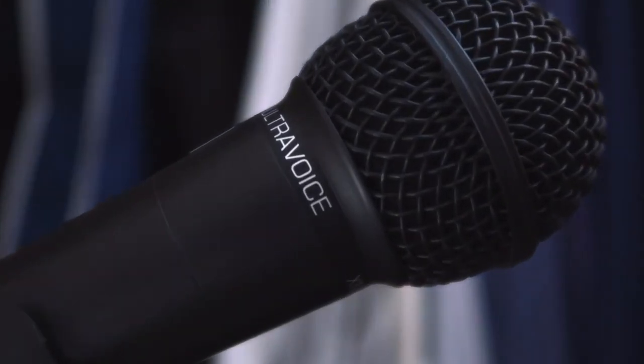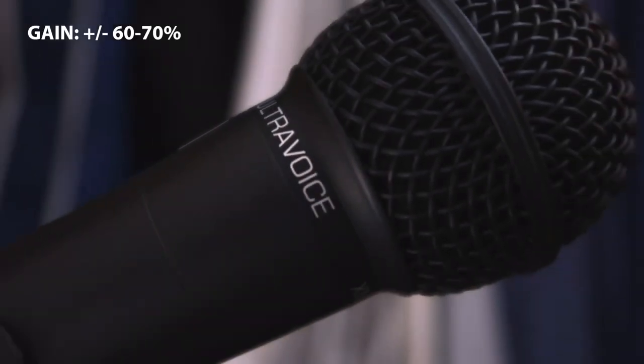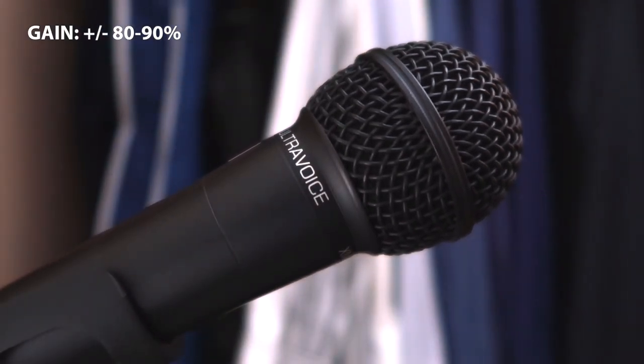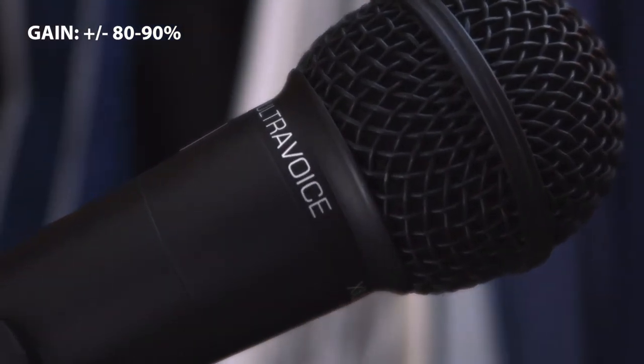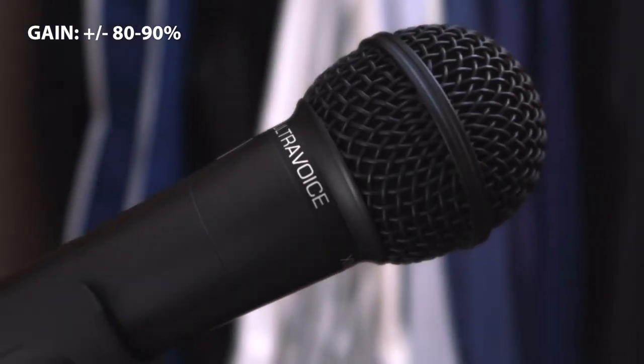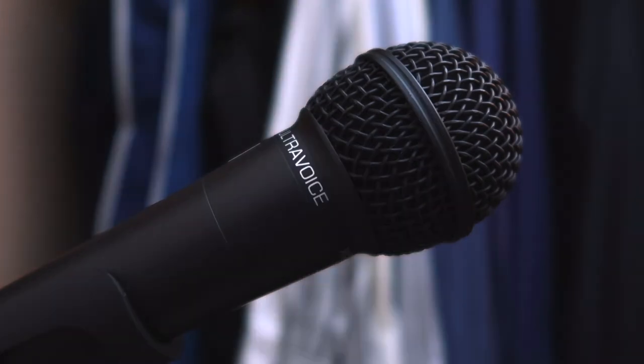So I'm cranking up the volume of this microphone. I now hear a bit of volume coming back and I'm still cranking up. And I think right there it's around 80-90% on this microphone. I think this is the sweet spot if you don't have a cloud lifter. But the thing is, I'm trying to modulate my voice so I don't hit the peaks and I don't come up distorted. So just in case you don't have a cloud lifter, you would need a lot of gain to get a decent volume or a decent audio level on this microphone.